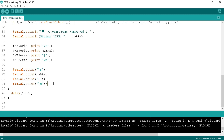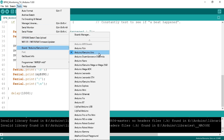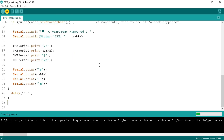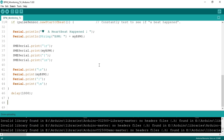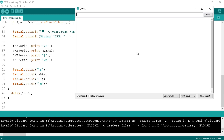Now connect your Arduino board to the computer, go to the Tools tab, and select the board as Arduino Genuino. Select the port as COM5, then click the upload button. After a while, the program will be uploaded to the board. Open the serial monitor to check whether the sensor is connected to the board properly. As you can see, we got the message 'We created a pulse sensor object', which means the sensor is connected accurately.